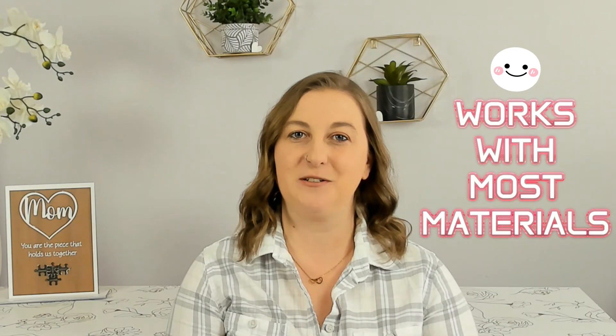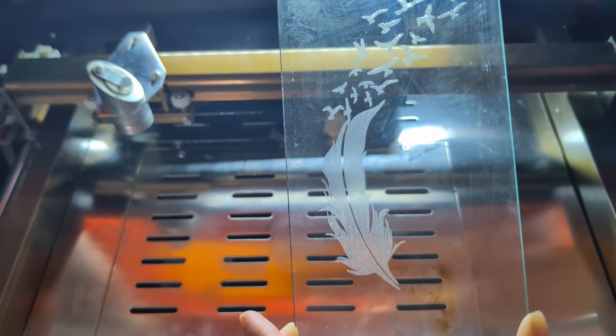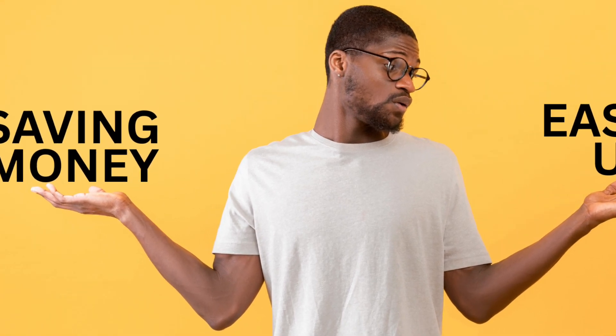Overall, it's a solid choice if you're looking for something affordable to get started with CO2 laser engraving and don't mind not having all the extra bells and whistles. It works well for tons of popular projects and materials like wood, acrylic, leather, and fabric. Most importantly, it was able to cut through clear acrylic and engrave on clear acrylic and glass, which my diode lasers don't do well. The setup was relatively easy, and switching to K40Whisperer makes controlling the machine much simpler, though it comes with limitations like not being able to adjust power through the software and lacking design tools. Still, if you're okay with these limitations, it's a great machine for hobbyists, and the price tag of under $500 makes it a really attractive piece of equipment. But keep in mind this machine is pretty basic — there's no camera, which is tough to work with as a beginner.